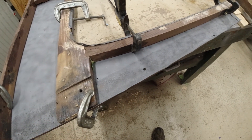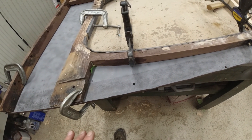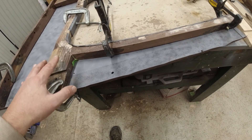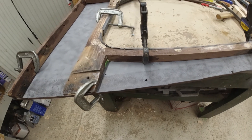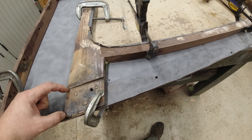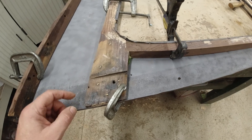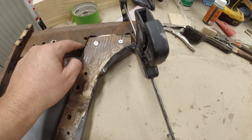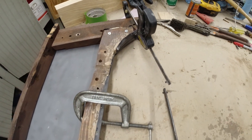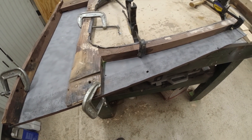The challenge of putting this back together is that you could put the frame together glued and screwed and it would be fine, but it's not necessarily going to match the sheet metal — because the way they did it was they put the frame together and then wrapped the sheet metal around it. They had templates and cutouts for all these pieces. If you look at the joint, the receiving hole is within maybe an eighth of an inch wide. They over-cut it so it would fit, used a jig to hold pieces in the right places when they wrapped the sheet metal. We don't have such a jig, so there's a good bit of play on how these go back together.